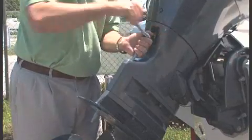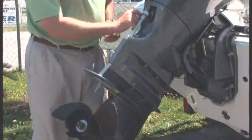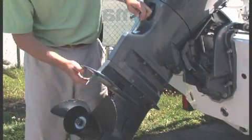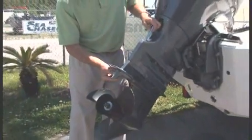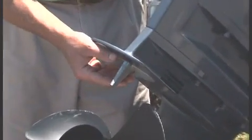And we're simply going to loosen it up — you may see it's actually turning now. If we're just adjusting the trim tab to get our outboard running straight, you just want to loosen it just enough so you can actually come and adjust the trim tab without it coming all the way off. Now, real important: which direction do we point the trim tab? That is dependent on which direction you are having the trouble. So let's assume your motor pulls hard to the right — you're simply going to move the trim tab to the right. You adjust the trim tab in the direction that you're having the issue.